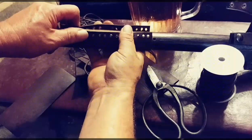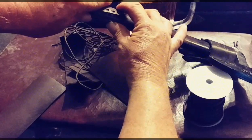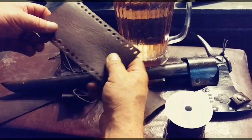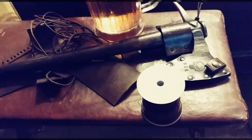The leather is thin on one side — more narrow on this side than on this side — so when I wrap it around, it's got a hole in the handle here and a hole here. When you cut it you want to leave a gap, enough space to stretch the leather when you're putting it on. You're going to take this piece of leather and soak it in water, which softens it so it stretches, and when it dries it draws up and gets tight.